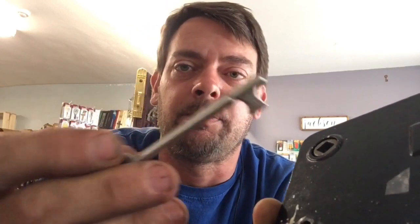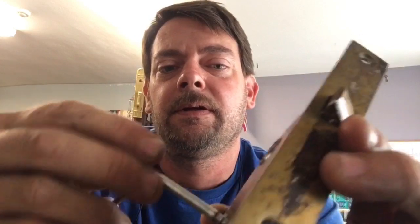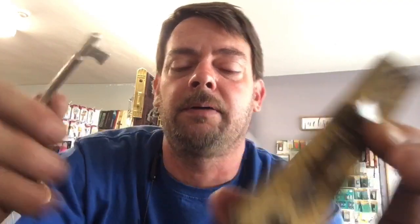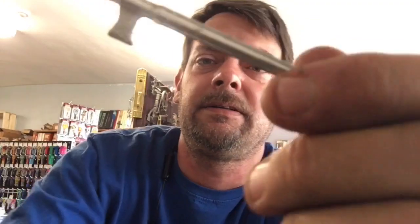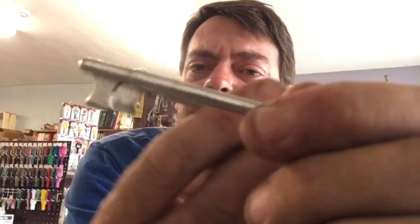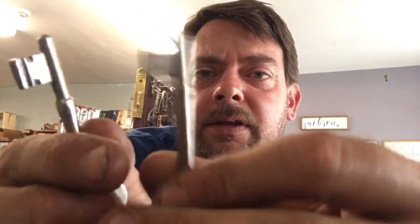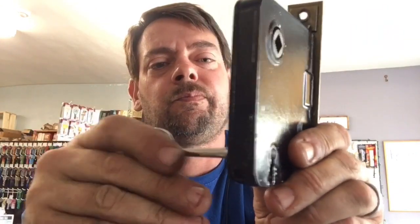sometimes you can get the pre-cut, pre-made keys, and they will also work the lock. That is because the side cuts where it's kind of curved out right there is designed to bypass any ward wherever along the key it may be, and the thin blade compared to the thicker blade allows it to pass the case. However, these are much cooler. Just thought I'd point that out. Sometimes they work. Don't get those plastic tip ones. Ugh, they're terrible.